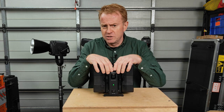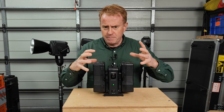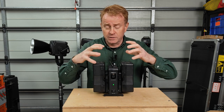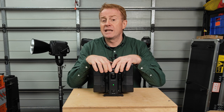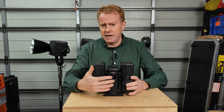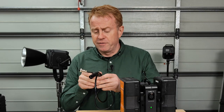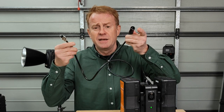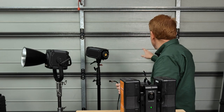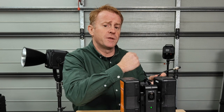If you're looking to use power stations like this to run 48 volt lights and want to run the batteries close to flat, you really don't want to be running anything bigger than 300 watts. I've tested this with an Aputure Nova P300 and it runs that very well. Also included in this kit is a cable which goes from the 3-pin to the 48 volt in on the two lights here, so this is the battery option available for those lights.